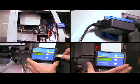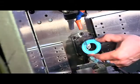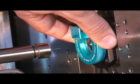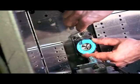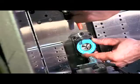Position the display unit on the machine at a height at which it can be comfortably read. Connect the display unit to the electric system and connect the probe USB connector to the display unit. Attach the adapter ring to the guide bush holder of the machine. Caution: the measurement can only be carried out on the cylindrical part of the tool, and only if it is not made of non-ferrous metal.